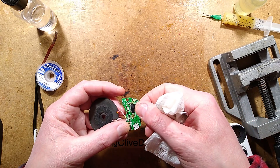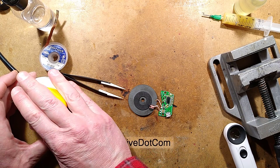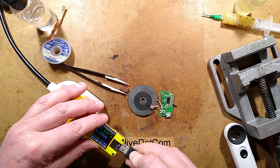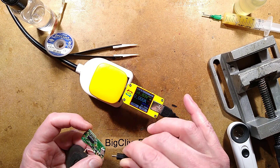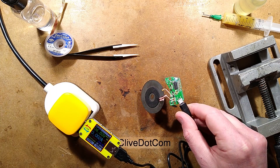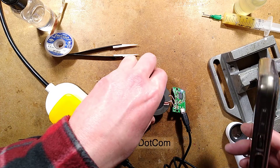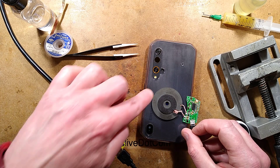It's very messy looking — hoping those components won't all interfere with each other. Bringing in the power supply, plugging in the power analyser, watching the current display and looking for smoke. It's only drawing 12 milliamps, flashing its little LEDs, doing things it's supposed to be doing. Placing the phone with a dot marker for coil alignment — it's communicating, it's started charging. Successfully put the chip back on without it bursting into flames. Currently drawing 600 milliamps from the supply, but that's because the battery is pretty full.